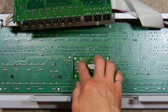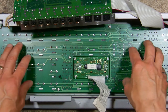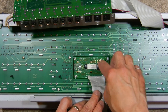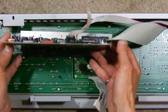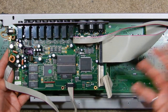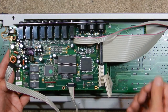That's the controller and the actual LCD display, and it's embedded into a third circuit board where all of the buttons and LEDs are connected. What I'm going to do is disconnect the LCD sub-board so I can pull it out, then plug it back into the main board and power things up to see what's happening with the backlight. Even though the synth is upside down and taken apart, I'll be able to power up the main processing board and the LCD.